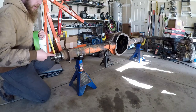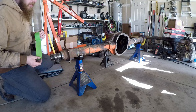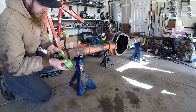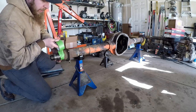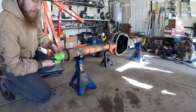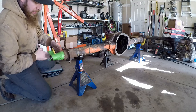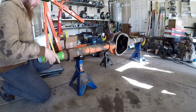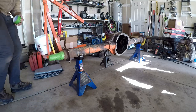I'm going to just tape these up. I don't want any spatter balls getting on these bearing surfaces or seal surfaces and causing a ruckus. The likelihood of that is pretty low, but tape is pretty cheap, so I'm just going to do it — then we don't have to worry about it.